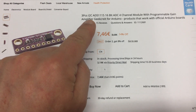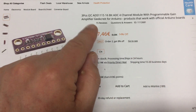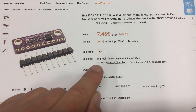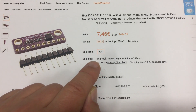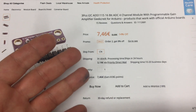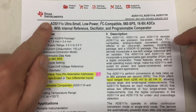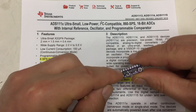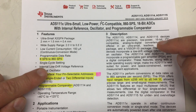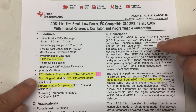Let's have a look at the listing. These were from Banggood - three pieces, I²C ADS1115 16-bit ADC four-channel modules with programmable gain amplifier for Arduino, 7.46. When I ordered them about four weeks ago I was able to get free shipping, which is no longer an option - maybe because of the corona thing. Anyway, the chip is Texas Instruments and at least the stamp looks original. 860 samples per second - though not all four inputs at once, that's for one input.